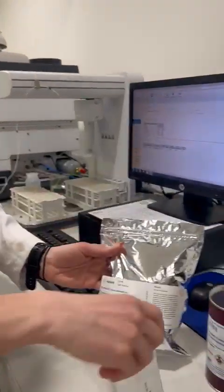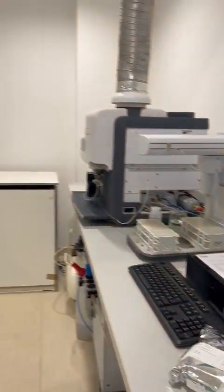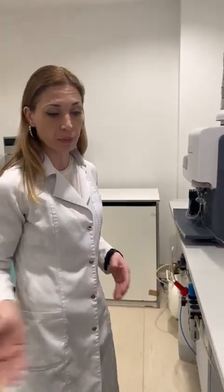Standards are prepared using only traceable materials. These are some examples of the materials. The whole idea is that whatever value is given for a reference material must be traceable, must be produced only by accredited producers of reference material, and must be accompanied by a measurement uncertainty in order to take that into account when assessing the measurement uncertainty for our results.